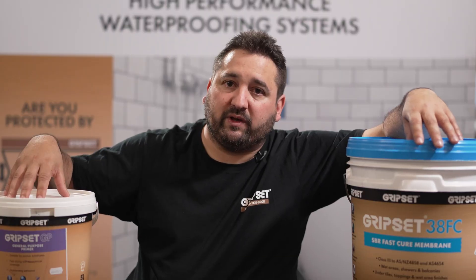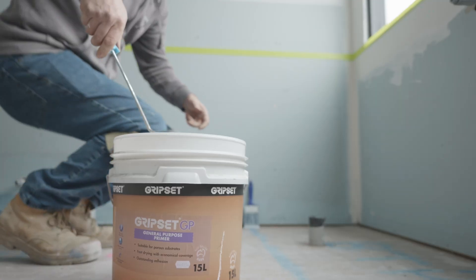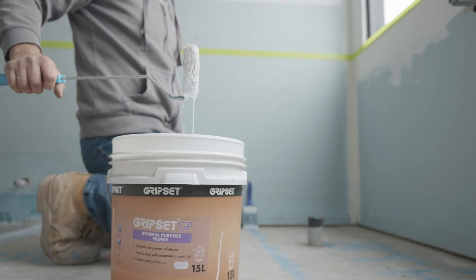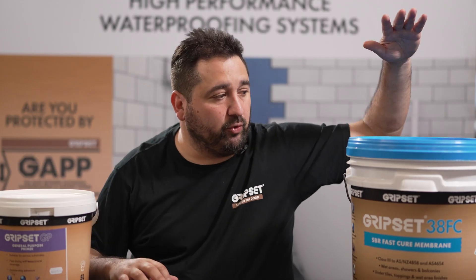After 20 to 40 minutes, around that curing stage, if you still have white puddles or excess primer you need to clean them up and then go from there. There are ways to give yourself an indication of how much it's going to cover, but you will need to do some trial and error. Ultimately what you're achieving with this type of primer is creating a seal — you want that primer to penetrate into the surface to give you a good bond, and then you're ready for the waterproofing application.